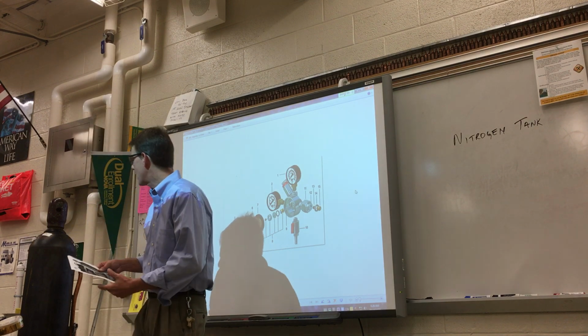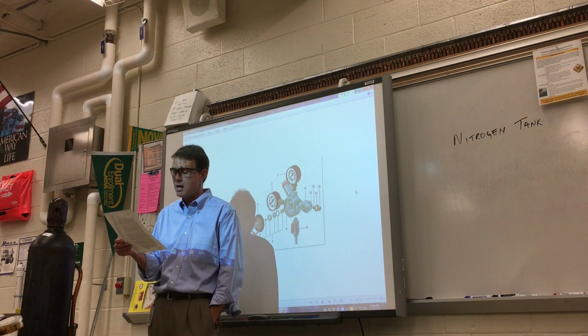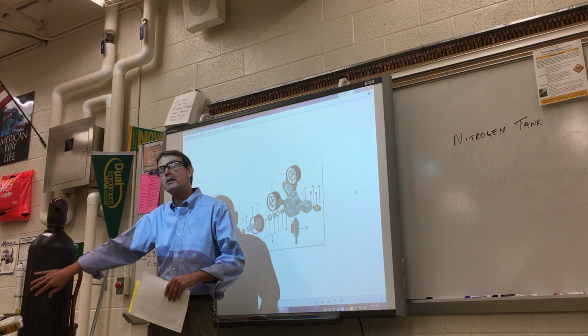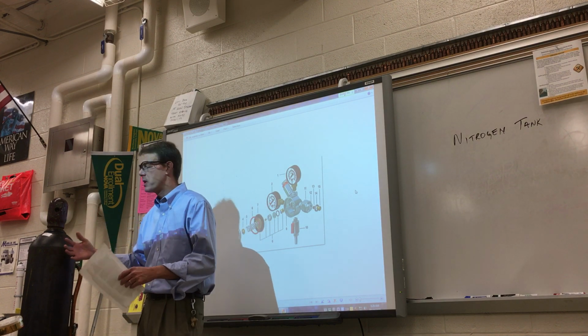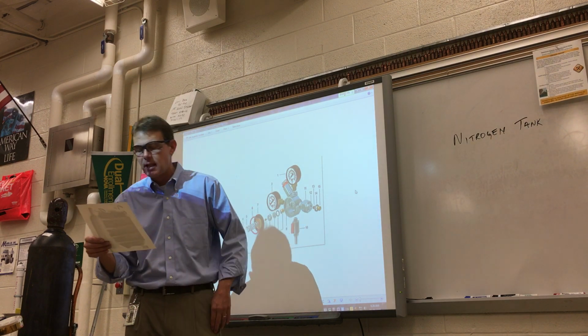They wear a label. So on the back you got a label. It says what it identifies with, what gas it's holding. In this case, it says nitrogen compressed. Color does not tell you what gas I contain. This thing could be blue, could be green. It used to be that they tried to use green for oxygen and red for acetylene, and then some other colors. But now a green tank, it could be argon, it could be nitrogen, it could be a bunch of different tanks. So you got to look at the label.